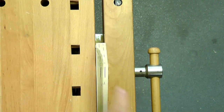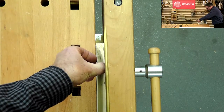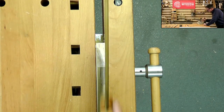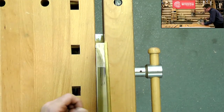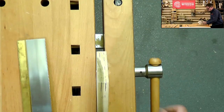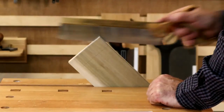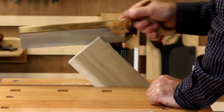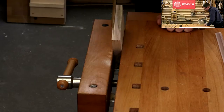So let's start our cutting. We've got the front shoulder and the back shoulder. I'm going to work on the back one first. I can get my thumb just off that line - I want to be on the outside of that line. I'm cutting on that corner, coming down to my shoulder line. Don't force the saw. I've cut down to here coming on that corner. Just going to blow the dust out - I'm going to project the line. So I've already got the line coming down the grain on the corner. This is a traditional western-style tenon saw - it cuts on the push stroke. Major thing: body stance, get it out the way so my arm will swing over my body.